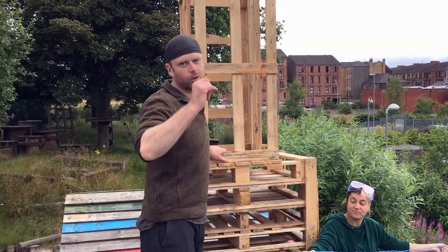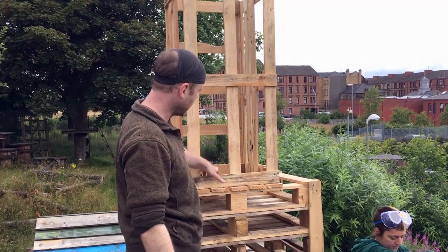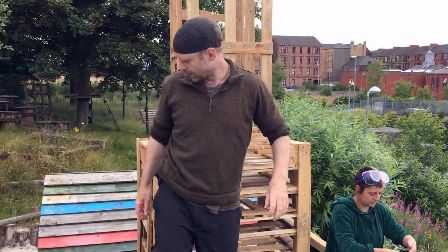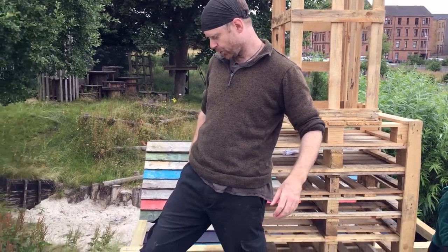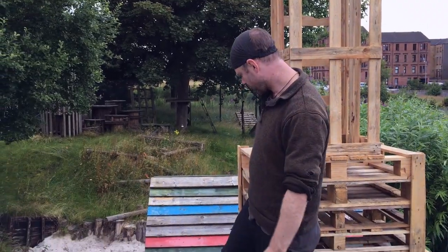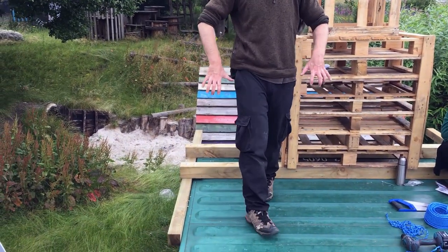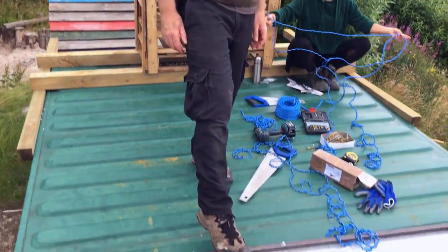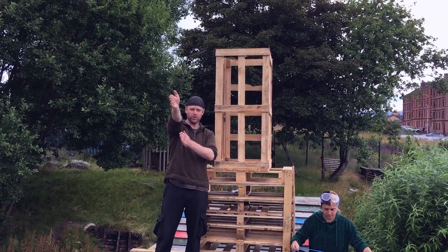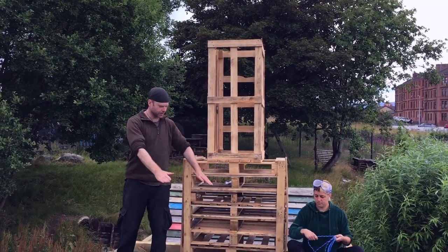So we have got the box for the barrel in place. That's screwed down, but since it's a tall thing in Scotland it's definitely going to blow over. We therefore have these bits of wood here which we're now going to attach ropes from each of these four corners up to here. These members here are bolted down through the lip of the shipping container so it's all stable on the base. This is the panel which we're now going to firmly attach here on about a 60 degree angle so it's aimed for the low winter sun more than the high summer sun but it'll get both.